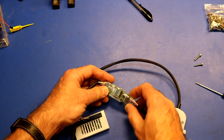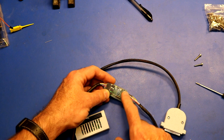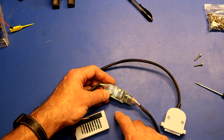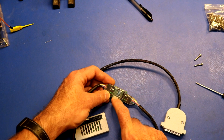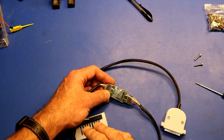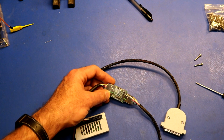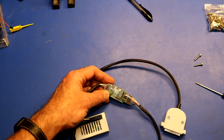And then we come into a little board here where all I've got here is a 10K pull-up. It's kind of a SIP resistor network for a 10K pull-up. Then I've got some 150 ohm protection resistors. That's just in case I misprogram the monitoring device, we don't accidentally put out a voltage on there and end up damaging something in the clock. Those 150 ohm resistors will current limit.